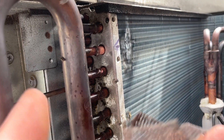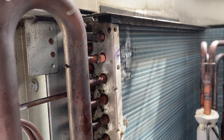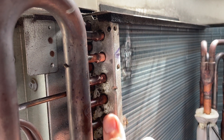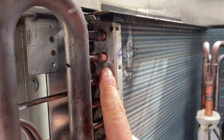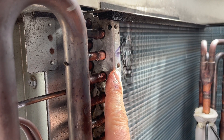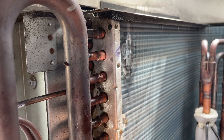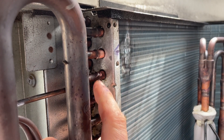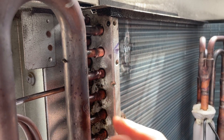Used a little piece of sand cloth as well and sprayed everything down with degreaser. The degreaser you want to use — you don't want anything water-based, it's got to be the type that's basically brake clean. That leak is right under here where this plate naturally sits. We're going to use safety-silv to get in here and braze this because safety-silv will bond well to ferrous metals — it flows easier and at a lower temperature than silphos. You don't want to use silphos on anything ferrous. We'll also use lots of flux to help clean out contaminants up in here where I can't really clean well.